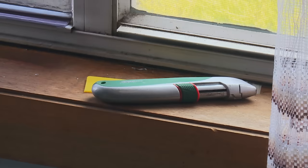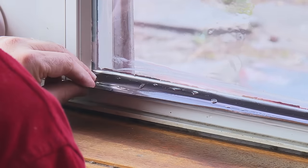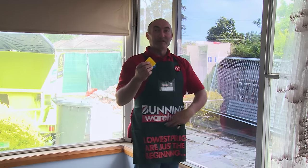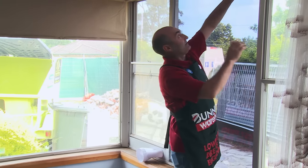After we've got all of the air bubbles out, it's now a case of trimming the top and the bottom. Once you've trimmed off the edges, get your little plastic scraper out again and tuck all of the corners in as hard as you can, squeegeeing towards the outside and getting all of the moisture out as you go.